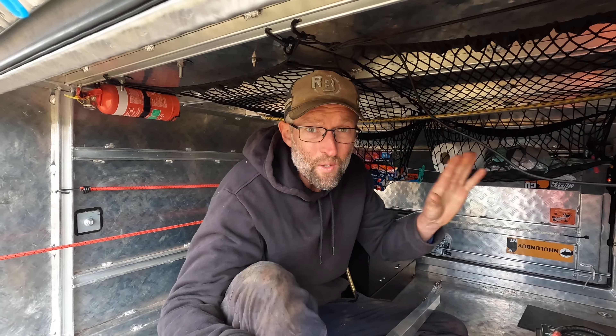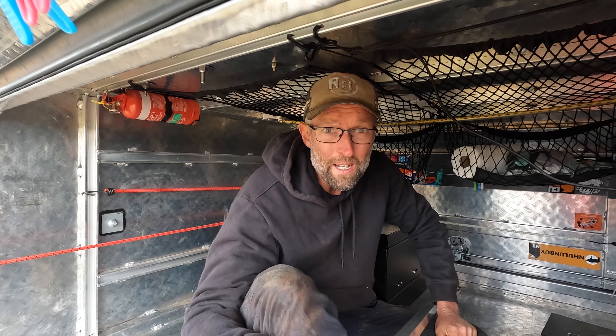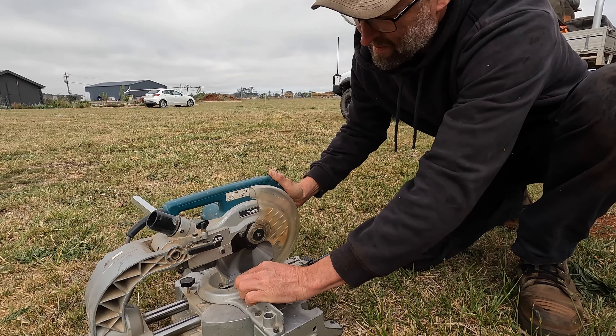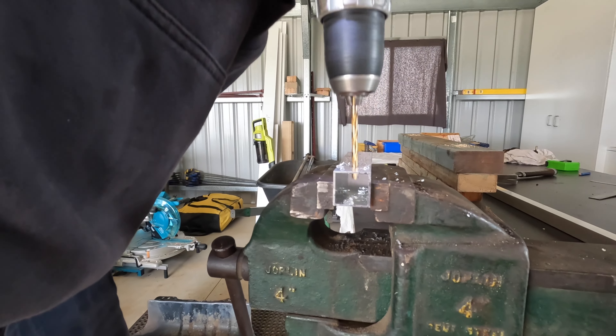One of the jobs I'd like to do is space the inverter off the actual metal canopy. When the sun hits the canopy it gets really really hot to touch, and I'm worried that it's making the inverter way too hot because that fan just keeps running all the time. So I'm thinking a bit of 25mm tube behind it — face it off, give it some more airflow and hopefully it won't get as hot.